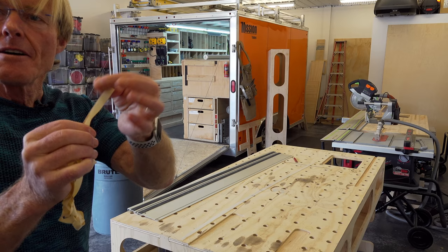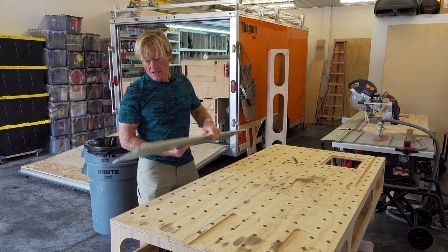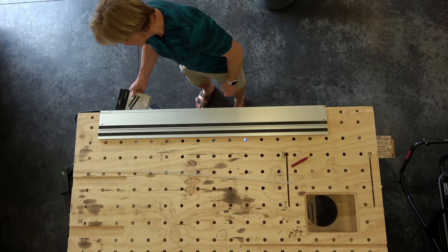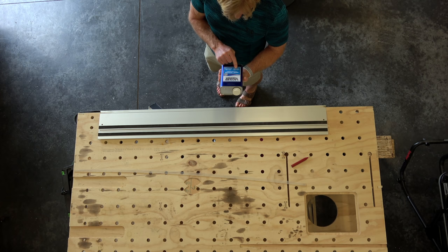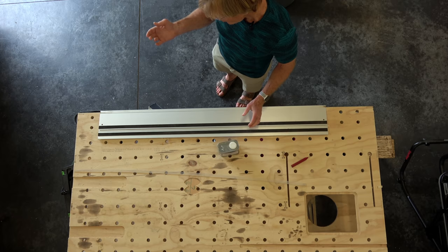I don't have Turner's tape, so I'm going to use an alternative that I think will hold up just as well. The next step is to clean the edge and make sure it's ready to accept the new double-stick tape. Festool's directions say to use acetone, and I've also found you can use isopropyl alcohol. I have neither, so I used lacquer thinner — that's all I have. I'm not recommending it; it worked for me and I don't think there's been any damage, but I would recommend isopropyl alcohol or acetone.